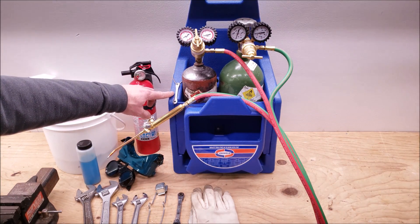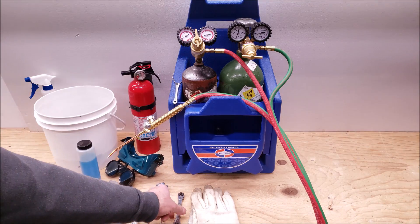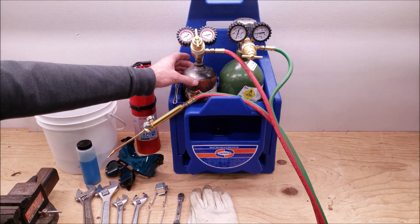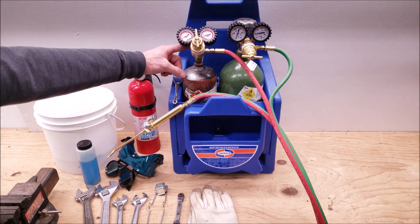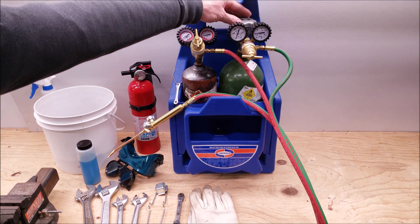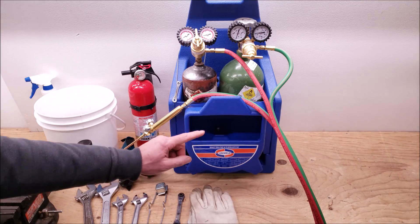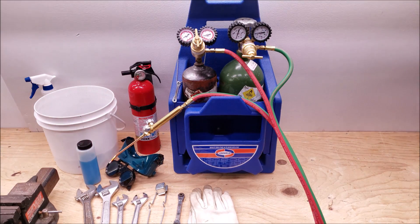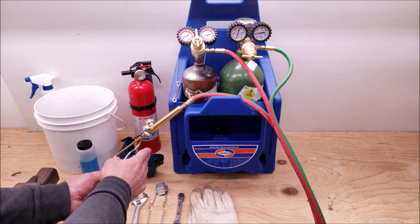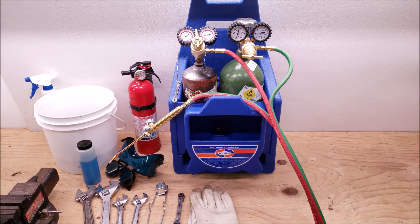You can use this to open up the acetylene tank. This is an MC tank — a 10 cubic foot tank — or you can use your ratcheting service wrench. We'll use gloves for safety from the heat. Some acetylene tanks have a handle instead of a key. With our oxygen tank, we have a handle up top; this is an R tank, a 20 cubic foot oxygen tank. We're going to be using a Uniweld setup with a number two tip, though we could also use a Captain Hook tip with five flames that projects heat toward the center of the hook to protect sensitive objects like a TXV or service valve.